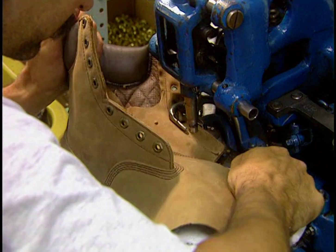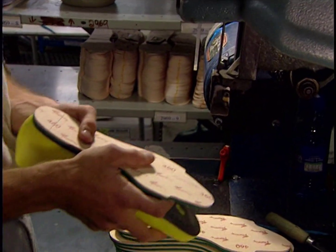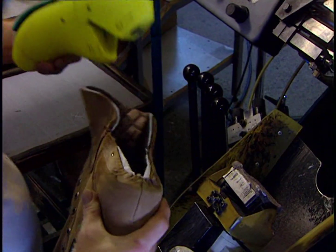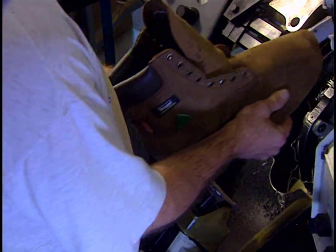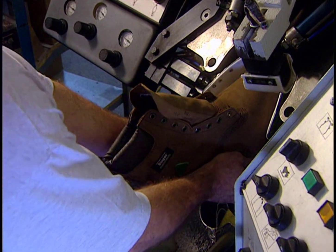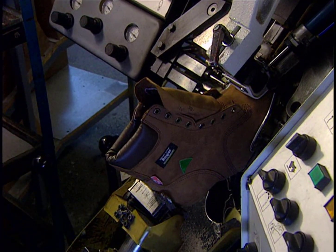The eyelets, made of steel, brass, or aluminum, are then positioned. Here they attach a foot mount on a form with tiny nails called tacks. The last is placed in the boot to facilitate the assembly of the front part. This carding machine removes any unevenness at the level of the lining before proceeding to the next step.